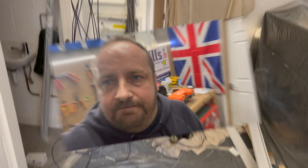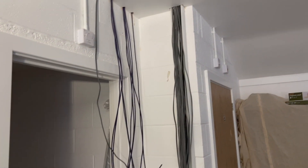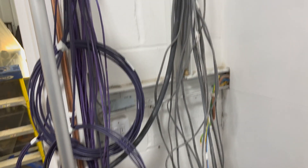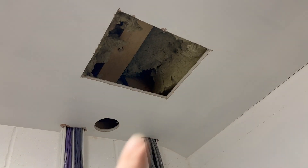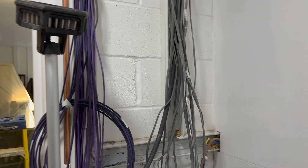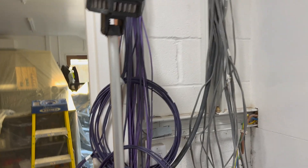Sunday morning, I'm here on my own. We got it all wired and got it all done. We had to do these access holes — I have actually got some fire sealant for where we had to bring the cables through because where the old holes were through they were sealed, and obviously there were no ceilings when it was all made originally. We found this light was actually — well, we always knew because there's no landlord supply — this unit does these lights and the main lights, and then that unit does the BT sockets. We had to take the feed to the nearest emergency light, which luck would have it was also circuit nine on that side.